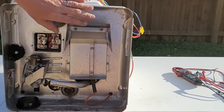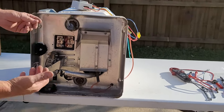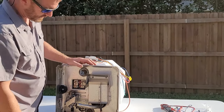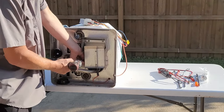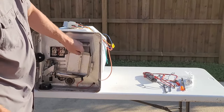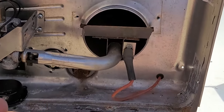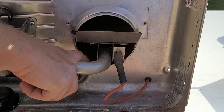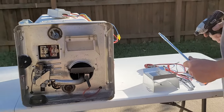Next, let's look at the combustion pan. This metal area protects the interior of the RV — if there's a fire or undesirable situation outside, it can't get inside and burn the walls. The combustion chamber is located here. After removing two screws, you can see the tube going inside the tank is split in half with a divider: the intake is at the bottom where gas and air enter and the fire is present, and the top is the exhaust, which is aimed up and out of the RV.